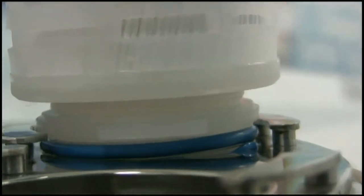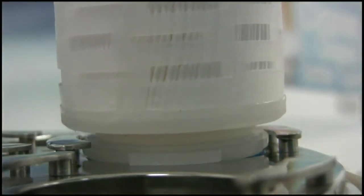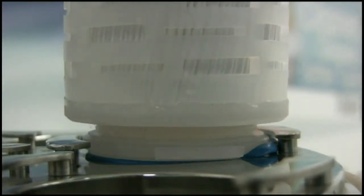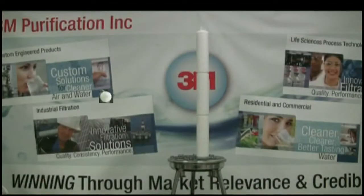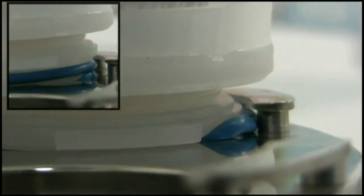Note that it is possible to have an O-ring dislodge from the filter connector groove and still be fully lowered into the receptor. In more obvious cases of a dislodged O-ring, the O-ring will be partially visible and the filter will not be completely lowered into the receptor. Both examples will cause fluid bypass and are likely the direct result of failure to maintain the filter in the perpendicular position when lowering into the receptor. In either instance, the O-rings are likely damaged and both should be replaced, regardless of any evidence of physical damage.